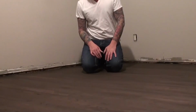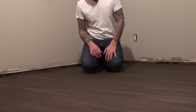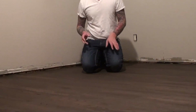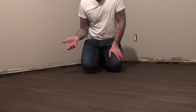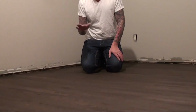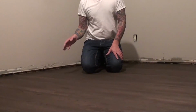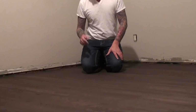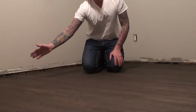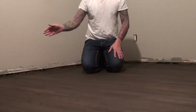I'm not going to show much about applying stain. There are many ways, and the most important thing is testing on a similar surface to find a look you want, and then do that look on the whole floor. I like to use a clean rag to apply my stain. Pour it onto the floor, skim it out, go back, wipe it off, and carry on.